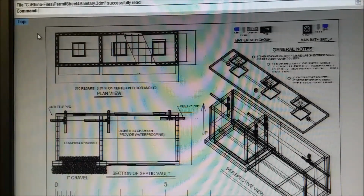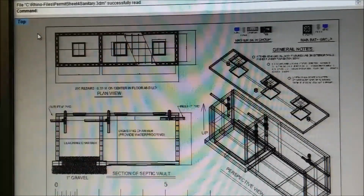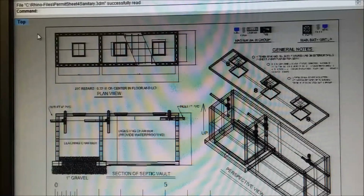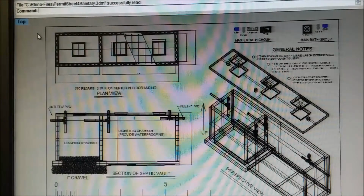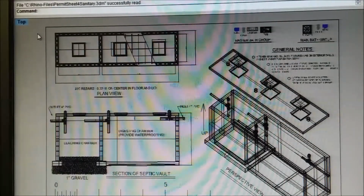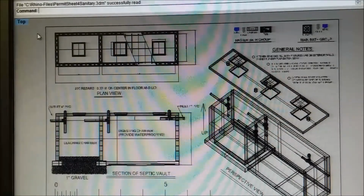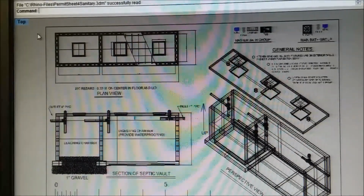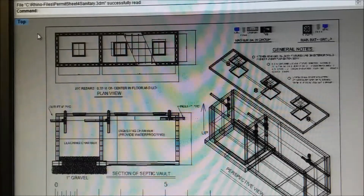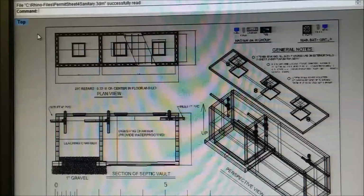But you have to send air through. That's why you've got an airspace on top of the tank. The exchange of oxygen and the methane that rises off, it's got to go someplace too. If you completely cap up a septic tank, you've not got a septic tank. So you need air. What we're doing is we're putting a couple of 6-inch sleeves through all the tops of the walls above the water level, and we're going to vent that air someplace away from the house. All we have to do is have an elbow and turn it straight up for now.